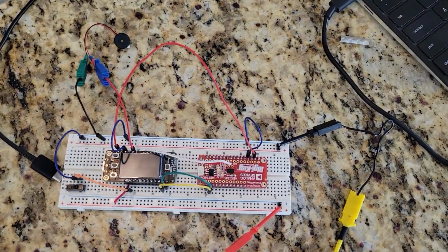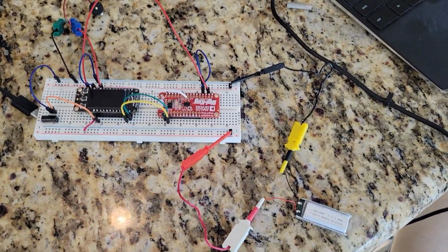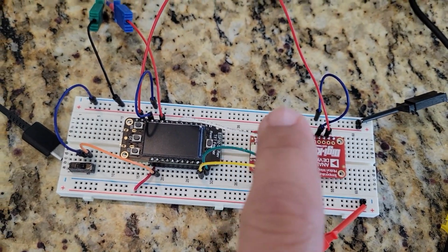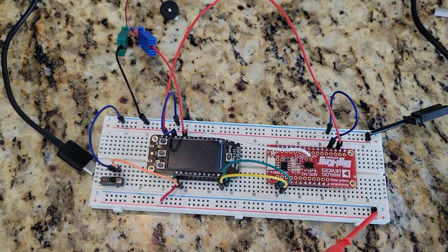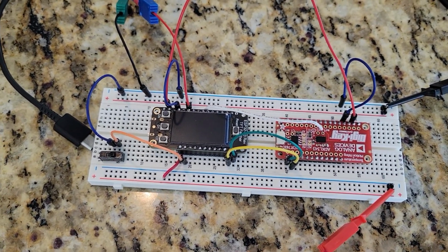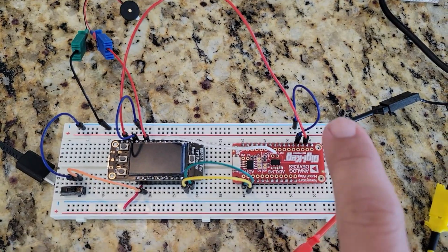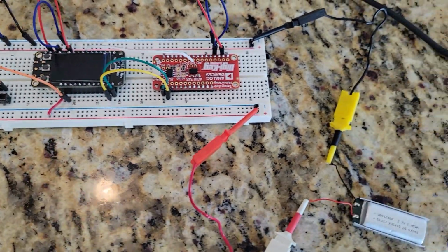Okay, so here we have the breadboard wiring of all of the components that we'll be using here. So let's do this in turn. These middle ones here are just basically connecting the left and the right board the way that they would be connected if we turn the sandwich over and connect them together. So we can ignore the green, yellow, this long red wire, and the ground here, because they will be connected automatically. But there's some other wiring we should talk about.